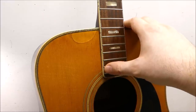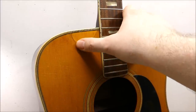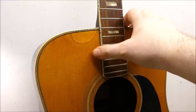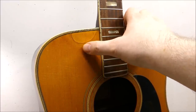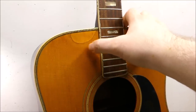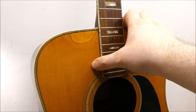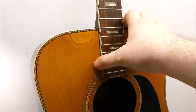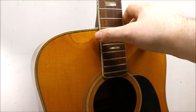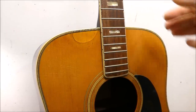It looks okay — it's in the same color family. It's not always easy. When you've got a horizontal line like this, end grain to end grain especially, it's just never going to disappear. And for whatever reason, this plywood here just wanted to soak up any color — even though I sealed the end grain, it just wanted to grab hold of that color and show it off like a dark line. Then you've got the 50-year-old spruce here with oxidation and lots of light exposure, and the new stuff just has a different refractive index as well. It looks great from a couple of angles, and from some others it sort of jumps out at you — just the holographic nature of wood.